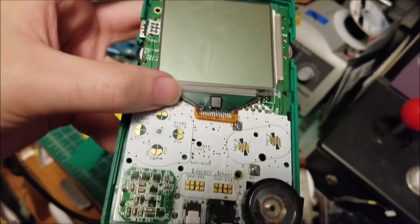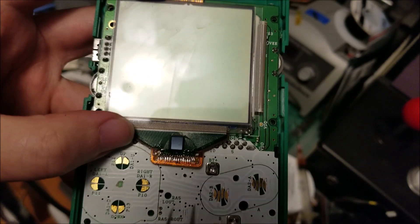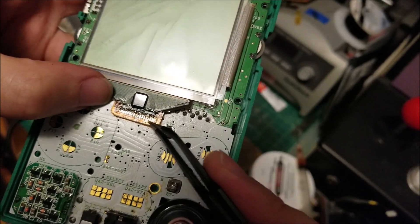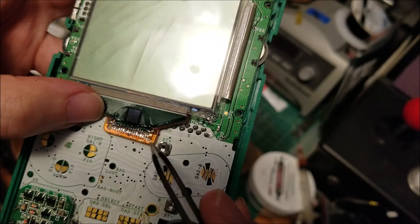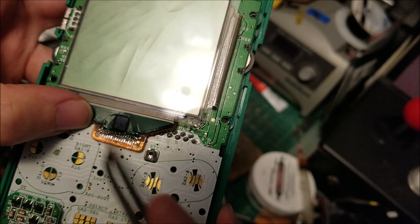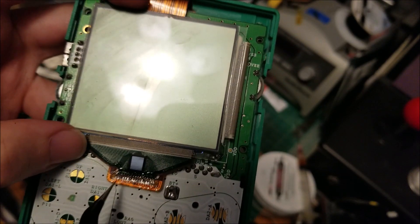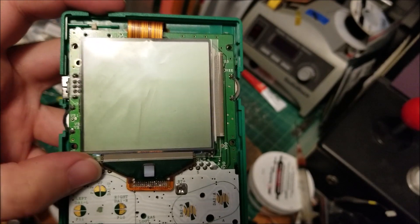Moment of suspense here. I re-soldered the bottom one, so the side and the bottom are now both soldered. You can see all I did was put a little bit of extra solder and dragged it upwards. Aligning it was a little tough, but once you get one pin on each end done, all you have to do is drag the solder up to touch the bits of metal still present on the green flex. Let's see if this powers on.